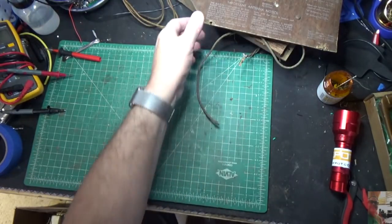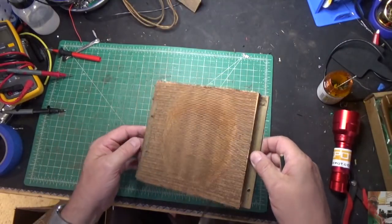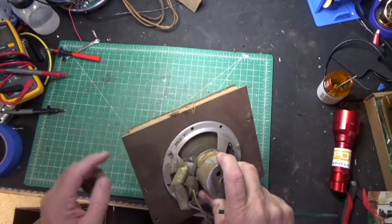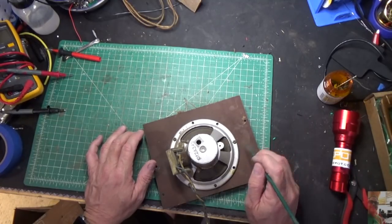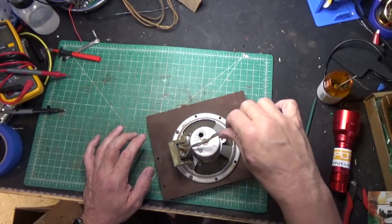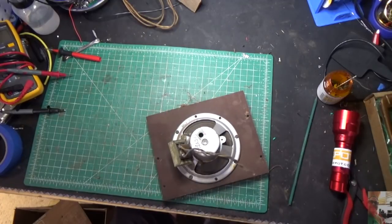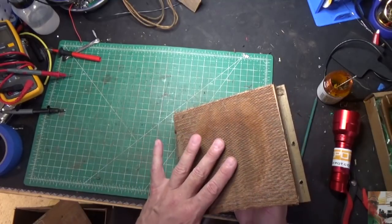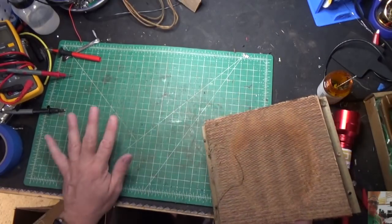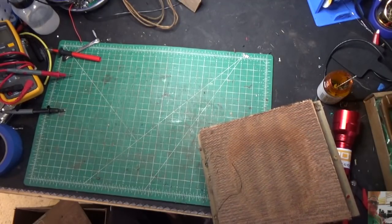We're going to start with the speaker. I took the whole board out to protect it — if I'd removed just the screws and taken the speaker out there's a good chance I'd put my finger through it. We don't want to do that. We're going to put some new wires here, and when we mount it back to the chassis I'm probably going to use some quick-disconnect Molex connectors — it just makes it easier if you ever have to remove it again to service it. We'll put a nice new piece of grill cloth on here.